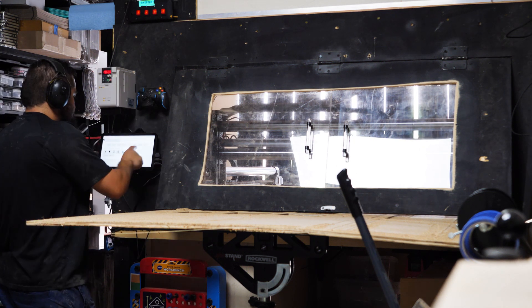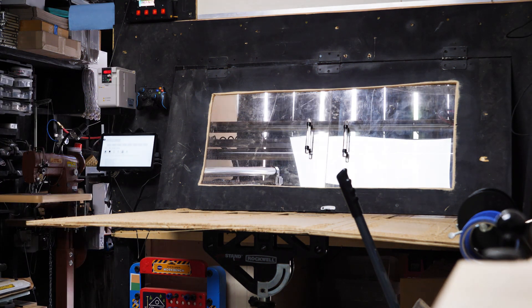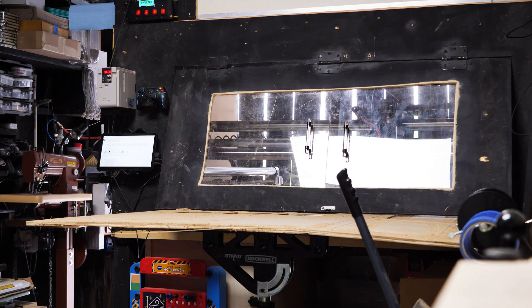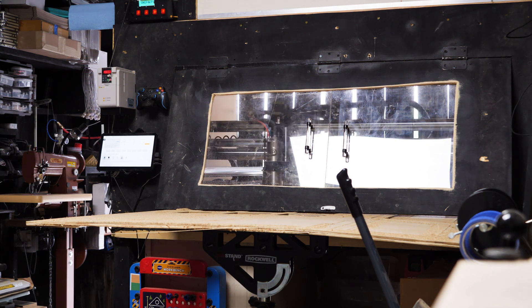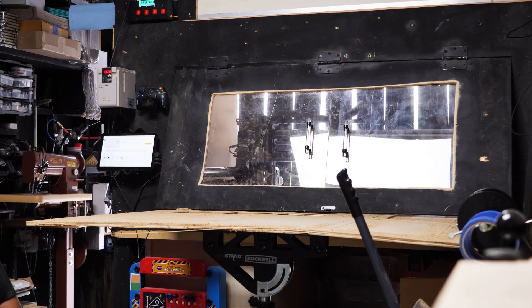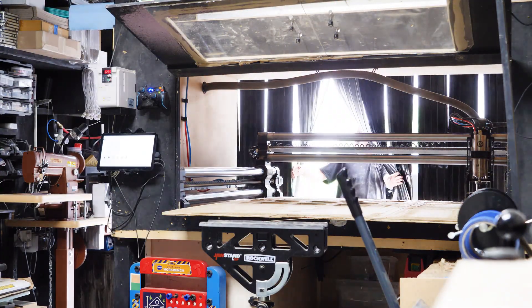I really just wanted to put a video together of something cool to make — both sides where you can do the tiling on a bigger project. I do four different sections, so all four sides of the telephone booth are cut out with the CNC. But if you don't have a CNC, don't feel discouraged — in the plans I'm going to put all the measurements so you can cut this out yourself. You can cut a simple plain version or do the outer borders if you want — it'll be a lot more cutting with a jigsaw but you can do it. I can also make it a printable stencil. I think the simplest would be to just use the measurements. After it's all done you're really just putting it together, and I'm going to show you that right now.